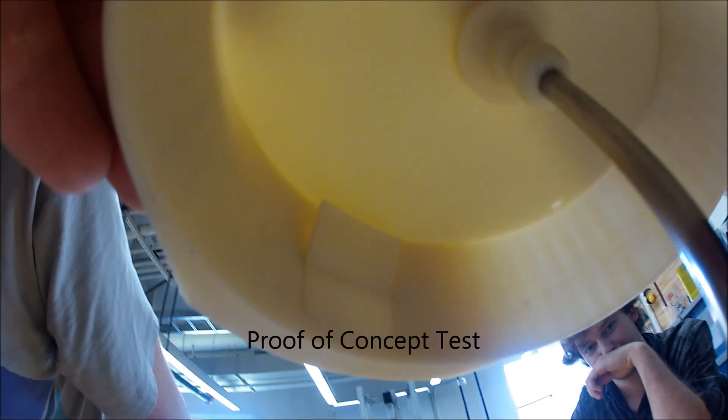The flap is designed to keep the grains out of the drinking spout when the basket is at the bottom of the cup. Only once the basket has passed the flap will it open and allow liquid to pass through into the drinking spout. The structural analysis testing for the Polish Pole consists of three main parts: the rod, the basket — more specifically the prongs on the basket — and the handle. The flap is closed and will open when the locking mechanism of the basket engages.